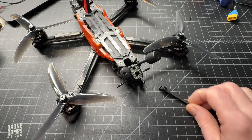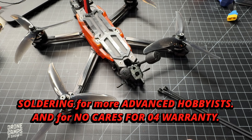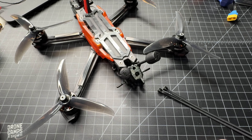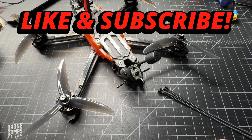Go ahead and open yours up and make sure it is not floating on top of the solder. If you're comfortable with it, add some solder very carefully so you don't destroy your O4. We just wanted to make a follow-up video because there are some easier solutions out there than doing soldering down to the connector on the O4 board — that's for more advanced folks and folks who don't mind voiding their warranty. You can also put a little hot glue there, or just zip tie your antennas. There are a bunch of different ways to add a little extra strength. Let us know in the comments — is this a fatal flaw for the DJI O4 in 2025? Take care — I'm Justin Davis, I'll see you on the next one.